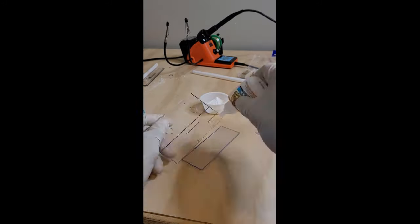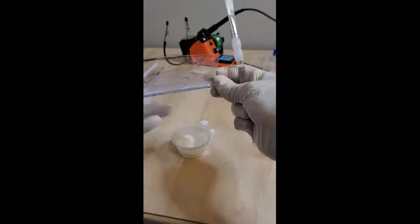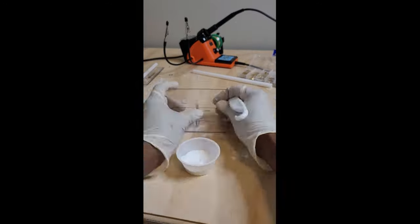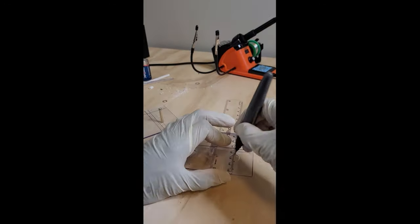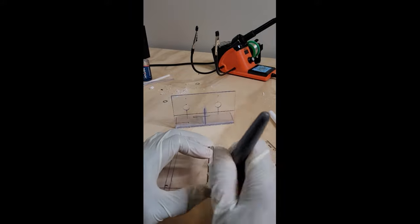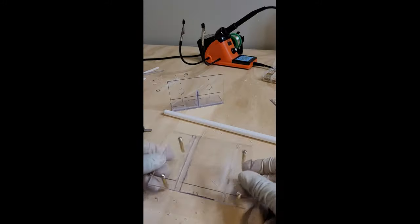The next step was building the mount for the engine mixture and propeller feather controls. I used a piece of 1/8 inch plexiglass, some Gorilla glue, and a little baking soda to strengthen the bond. Then I marked and cut the holes for the variable resistors and used some hot glue to keep them in place.